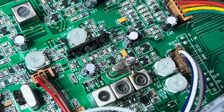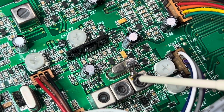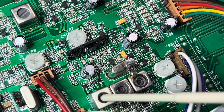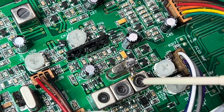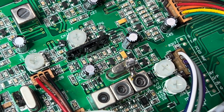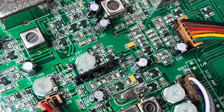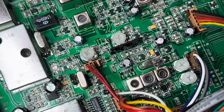All right. You have 18. This is 18 AM. Lower sideband. And this one's going to be upper sideband, right? So you have L20, L19, and L18. The AM sounds good, don't touch it. There's no need to. If it doesn't sound right, touch it. These are the ones I'm going to be adjusting, and I want you to listen while I'm adjusting it, okay? I got to zoom you out a little because you can't see what I'm doing here.